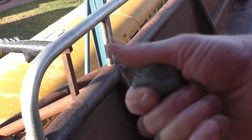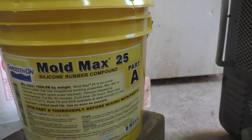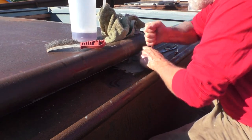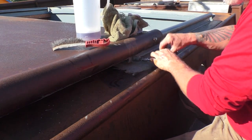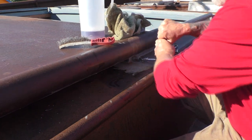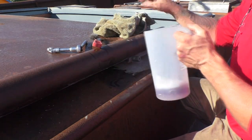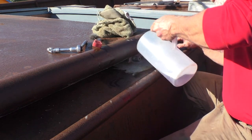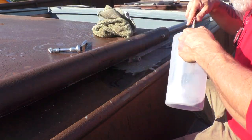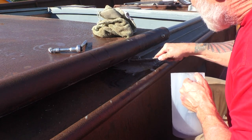I've got to say that the clay made a wonderful temporary gasket. I'm going to try using this silicone rubber molding compound from Smooth-On. All we did is we welded sockets onto this thing so we can put a handle on it — I want something I can turn with a little more leverage than eight inches. I'm going to clean up that clay — it's oil-based clay, so a degreaser should help. They said a sulfur-based clay would actually react with the silicone to keep it from hardening up. This is an oil-based clay, but just the same.